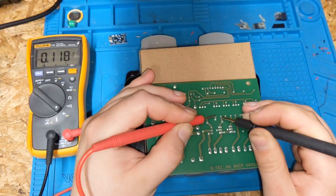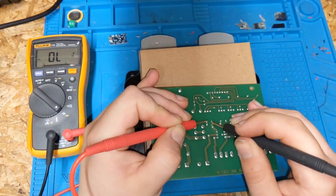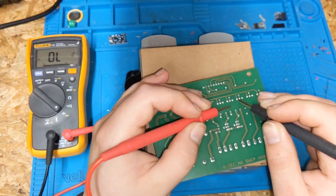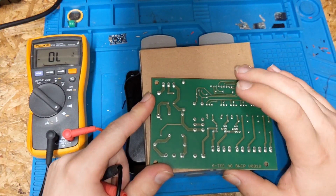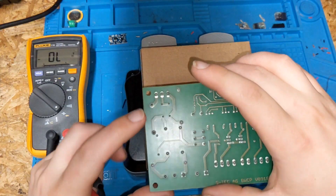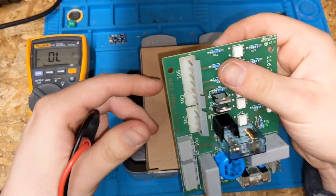0.1 on that side, nothing on that one, nothing on that one. So on this one here we have a triac that's shorted, and then we have an opto-coupler that is — well — shorted again, showing resistance when it's not engaged.